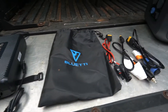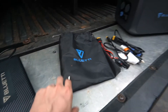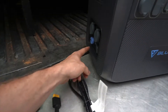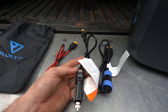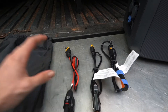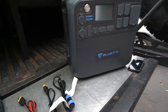Here's what comes in the box. This is the main AC charger that plugs into a wall outlet and into the side of the unit. There's also an adapter that screws into the unit, letting you add 12-volt DC power from your vehicle or solar power. These are standard MC4 connectors, so not only will Bluetti panels work — any solar panel with MC4 connectors should be compatible.